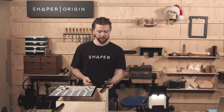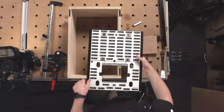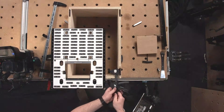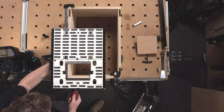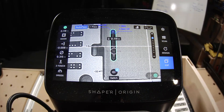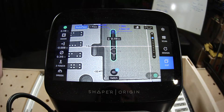Now we can move to the next side by repeating the steps: deploying left side flags, pressing firmly up against both of those, and clamping into place. I've taken the left side of the file and placed it at negative 70 by negative 50, which will put us right down here on the bottom left corner of our box, and everything is spaced out for you perfectly.